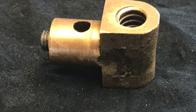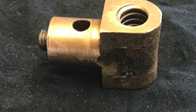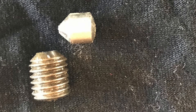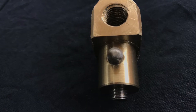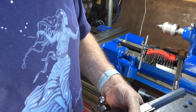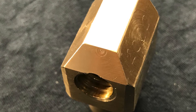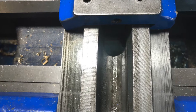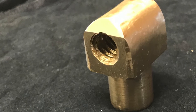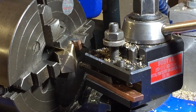Apparently the later models had a split down the middle of this nut and a tapered end on the grub screw which, as you tighten it up, would spread the threads apart and make it adjustable. Mine was just a simple plain thread — the grub screw did have a taper on the end, but it pressed on this pin which is also tapered, and pushes the pin out sideways to lock into the casting. That's what holds it in place. The peg is supposed to face the operator according to one online expert, though I don't know why. I thought I'd get away with just making the end tapered rather than a fancy curve, but when I look closely at the channel it runs in, it actually rubs on the channel to keep it in alignment. So I filed it back into a semi-circular shape.